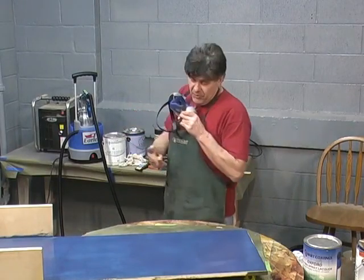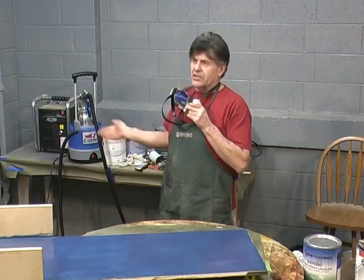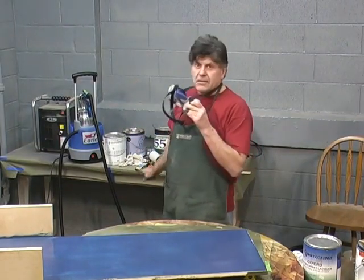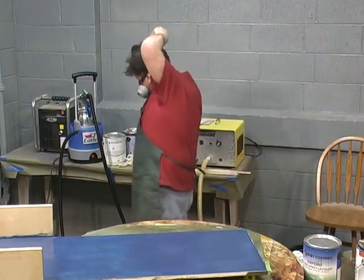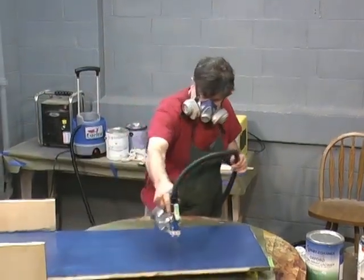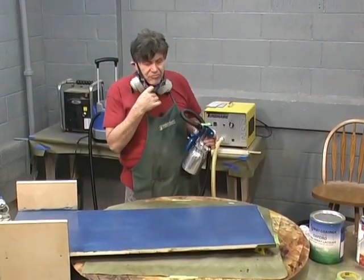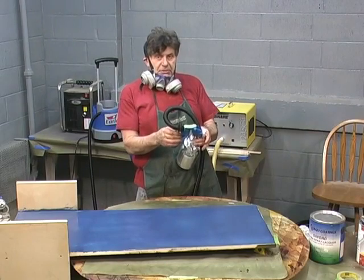All right, what I got over here, y'all supposed to be watching this, not me anyway. What I got is the 2.0 needle nozzles. Some gun companies call them atomization kits or atomizing kits. And I haven't changed the fluid setting at all. Now we've got a very heavy viscosity water-based finish in a two-stage turbine. Let's take a look. I'm getting a breakup, but I'm not getting any fluid. So I'm going to back up and give me some more fluid.